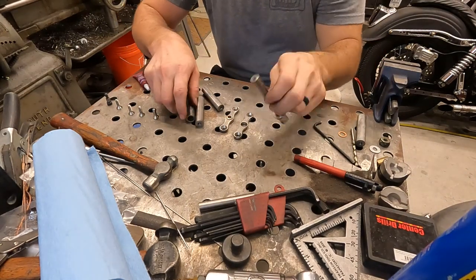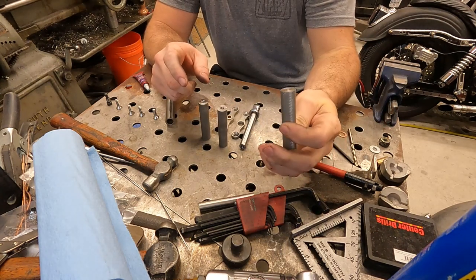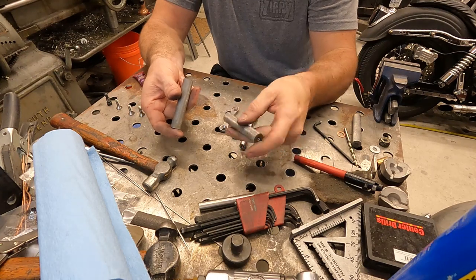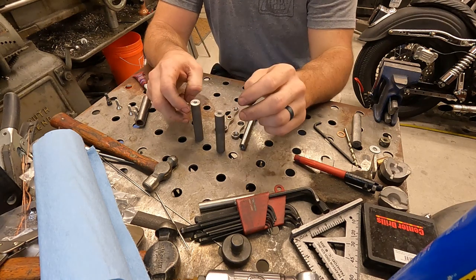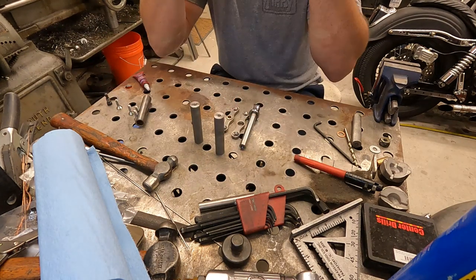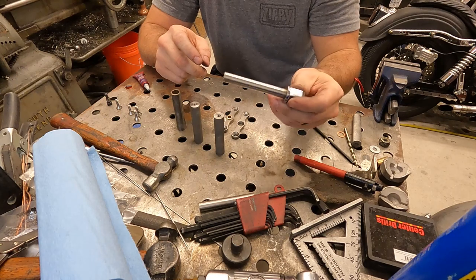Finally, we have all of our parts machined. These were fighting me super hard. This was a previous one. Broke two taps off before we finally got these off. This is all stainless, so it's a pain in the ass. But we finally got it all done. I changed some processes. I drilled these a little bit bigger, because really there's no lateral pull on the threads, it's all shear, so it'll do fine.